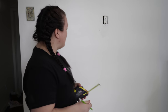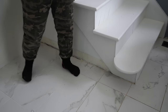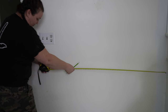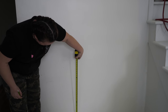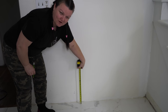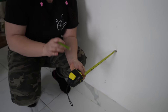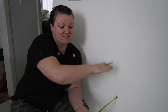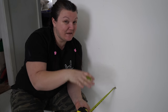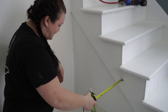I've already figured out I want my bench to be a sectional. One direction it's going to be 52 inches long, going to approximately the start of this pillar back into the corner. It's going to be 18 inches high — standard chair height — plus a cushion on top. It's going to be 16 inches deep, so no deeper than a regular kitchen chair. I literally just followed the dimensions of our kitchen chairs we already have.